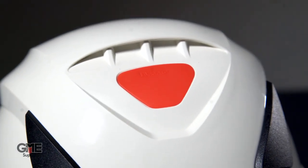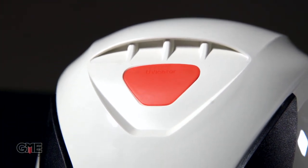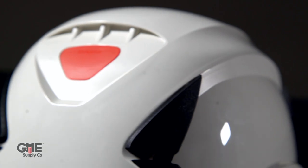The UVicator sensor installed on the back of the helmet changes color from red to white the longer it's exposed to UV light. When the UVicator turns to white, 3M suggests you take your helmet out of service, because all that UV exposure can make the plastic in your helmet more brittle and prone to cracking.